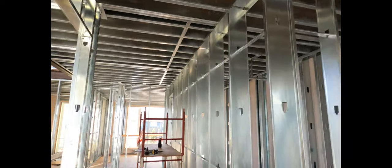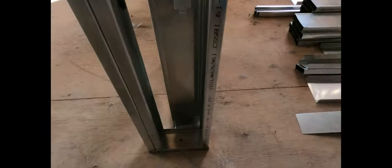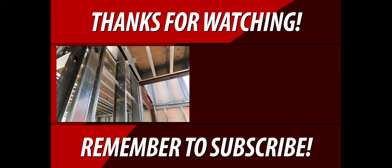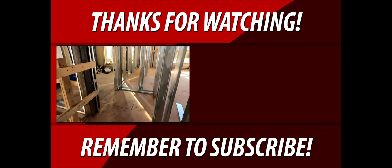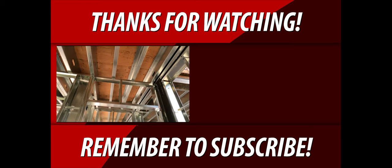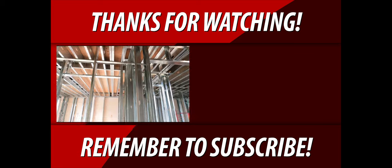Here's another example of the floater corner — two door studs. The one in the bathroom is bigger because it's a pocket door. Wherever the door swings, usually going inside to the wall, that's where your short stub will be. This corner here — we're going to be burying a column, so you've got to think of these things during layout. If you have any questions, leave me a comment. This is Chris — another metal stud framing video, hashtag cronies, bye for now.